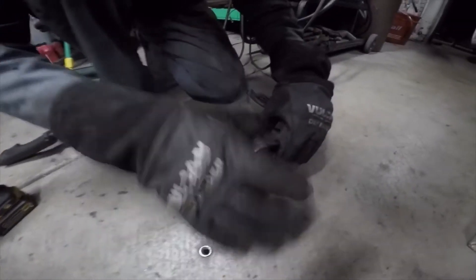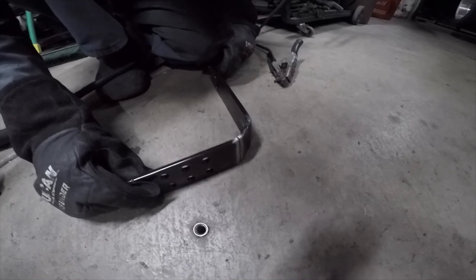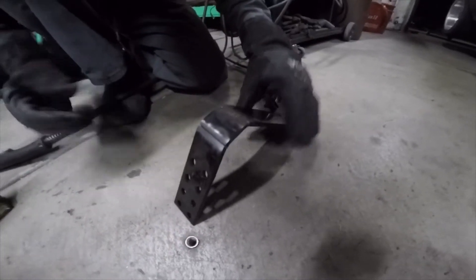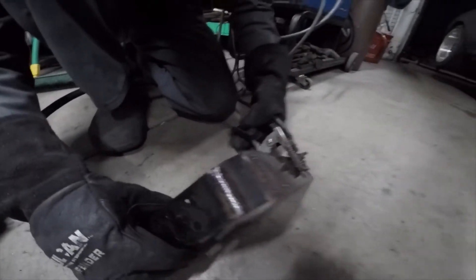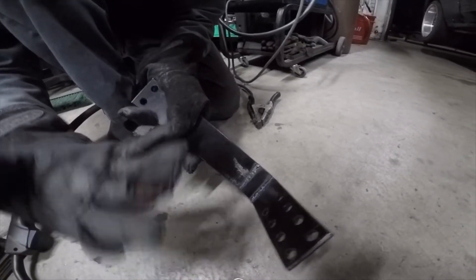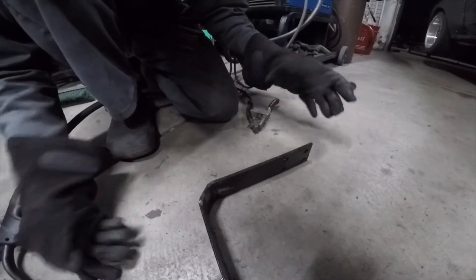The first one is welded and done. Now we're welding the second one, making sure it's still at a 90-degree angle — it did move a little bit on us while welding, but we're back to 90. I tend to pulse weld because I can control the heat really well. Both sides are now welded; if you did it right you have penetration all the way through on both sides. We're going to let it cool down and paint it.